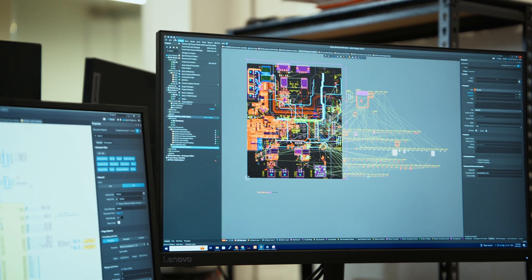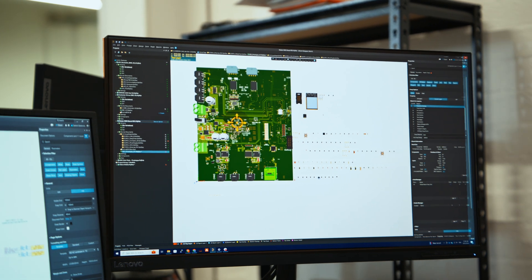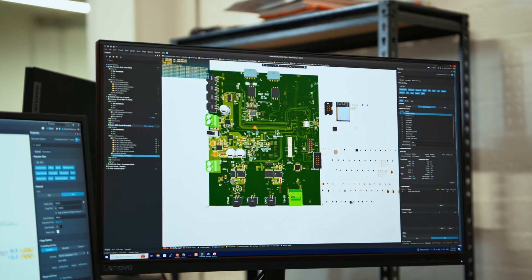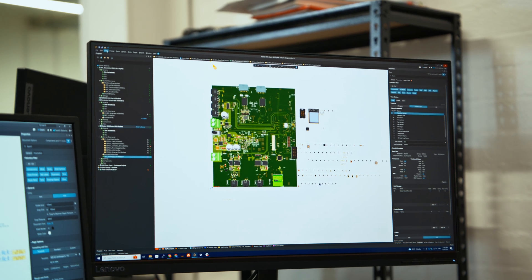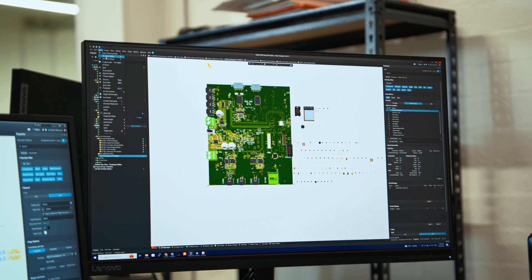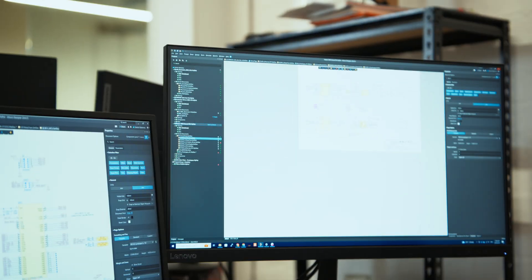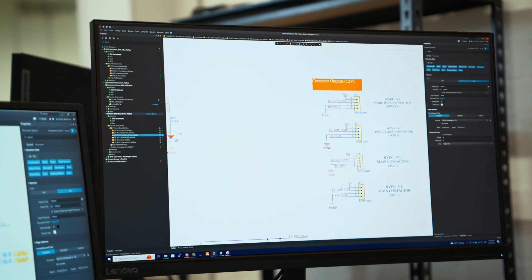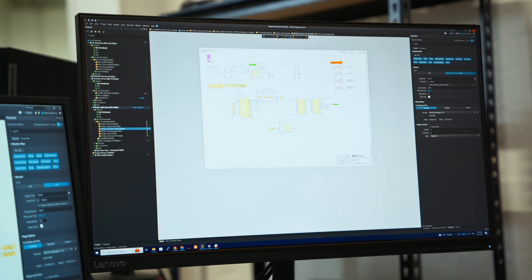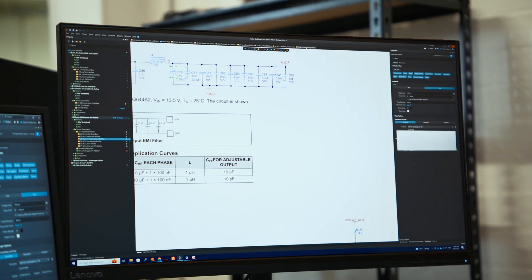At the moment I am in the depths of doing the layout for that. You can see here a rough overview — slowly placing all the components. We start off at a schematic level with high level functional blocks, and as we dive into each of the individual blocks you get a bit more detail. So this is the CAN interface. We have our contactor drivers, which are a series of integrated circuits and some MOSFETs. And then we have our power supply.